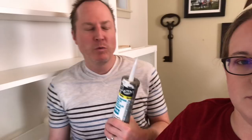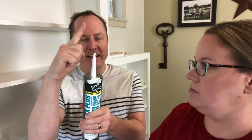Yes, exactly. So we are back and we are going to caulk. Jace, you wanna show the little? So when you do the finishing nails and when you put things together, you want to make it look smoother, so caulk is what you do. So one trick is when you cut off the top, cut it at an angle. I actually screwed up and just did straight off. It's been a while. But if you cut it at an angle, it makes it easier to squeeze the caulk into the little cracks. You'll see, plus a little bit of water, so you get your finger wet and wipe out the extra. Those are kind of the tricks. Cut this at an angle, a little water to wipe out the extra caulk, and it makes everything look seamless. It covers up the holes. Okay, we'll show you how.